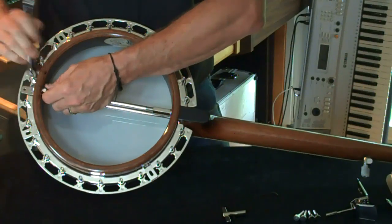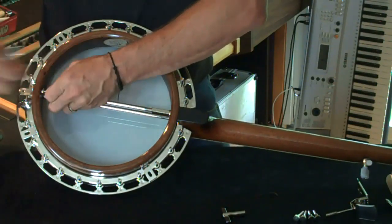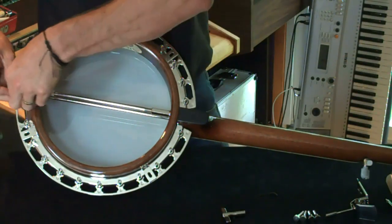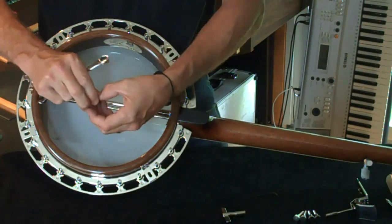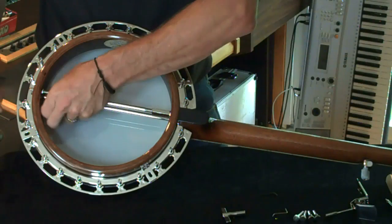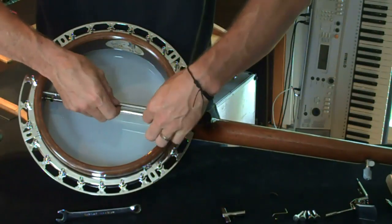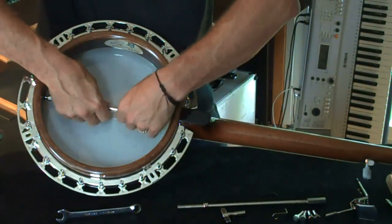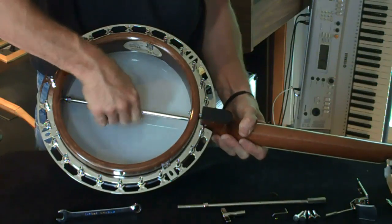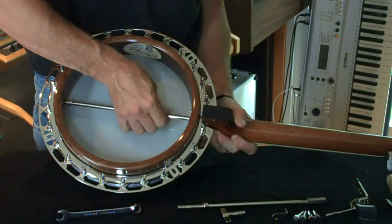So what we're going to do here is loosen off this bottom nut and the inside one — just make sure they're good. Give this one plenty of release on the thread because we're going to need to undo it from this end and pull it back. On this particular model it is actually threaded this end, so we can avoid how much we have to pull it back. On other banjos that would just be a one-piece coordinator rod with no thread and obviously less adjustment. This one here is already finger tight anyway, so there's no big problem with that. The coordinator rod itself is only finger tight against the neck, so in my opinion that's hampering tone because it's not as solid a construction with the neck as it could be. This is very loose. I do like to tweak these up so it's a good firm joint. There's a lot of time and effort put into cutting the neck joint, and it seems rather silly to not have it tweaked up nice and tight to enable that neck joint to be as secure as possible.